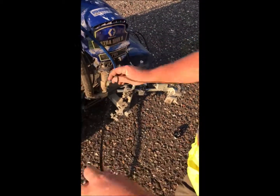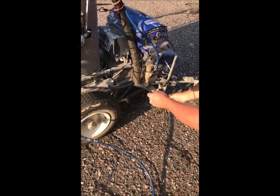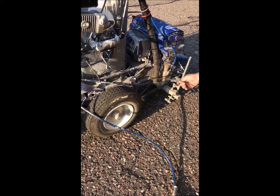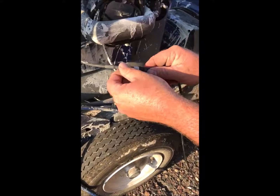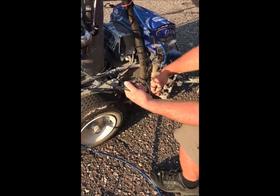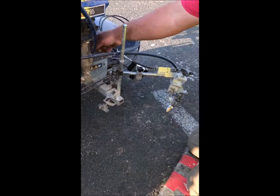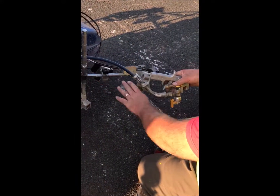I'm going to run it on the backside of my pump here, keeping it out of the way of everything. I like to leave a little bit of play down by the gun, and I'm simply going to plug it in. Now that it's plugged in, it's a live working dot laser. I'll wind up the extra cable and zip tie it up. We've got our laser mounted, our power cord plugged in, and it's right up to the working switch.